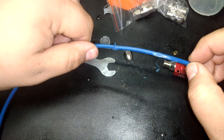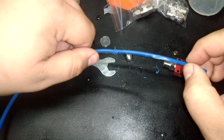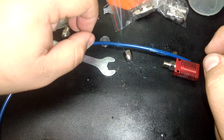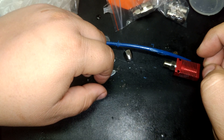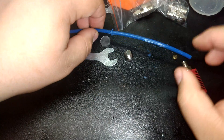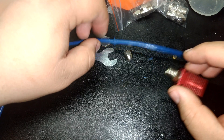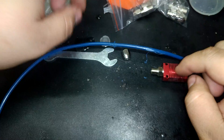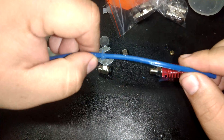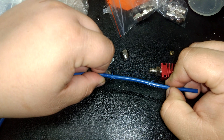The issues when we compare these two are not obvious right away, but they are definitely obvious over time — that's what I've found. How much do you want to do maintenance? How often do you want to replace one of these and have a failed print? You don't need outright strength. You just need reliable and consistent strength in both directions. I still stand by that the compression fitting with a ferrule is better than the pneumatic coupler. Just look at how it wears the Bowden tube and you can see which one does more damage.